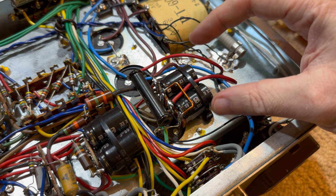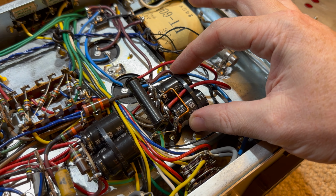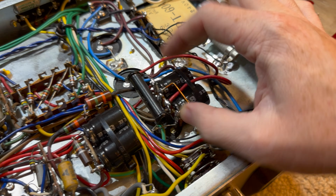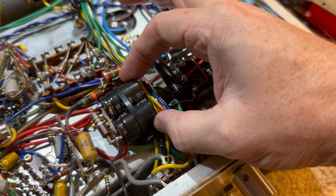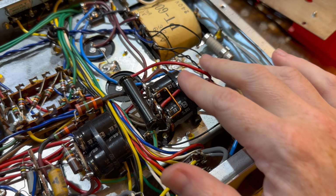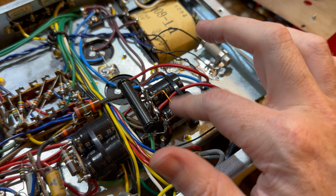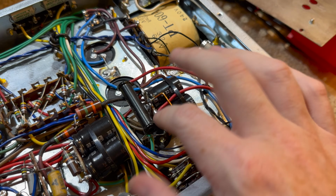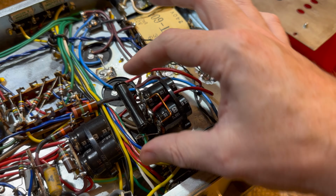So there's like a terminal strip, two caps on each. Yeah, so they're really solid. That one's maybe not as solid, but it ain't going anywhere. This one is not budging. I had to add this bridge wire for the ground, and that's just for stability more than anything. It doesn't need to be that big or anything, but it just helps hold the caps together at the base.